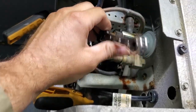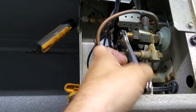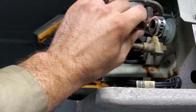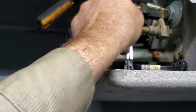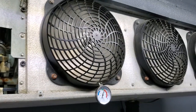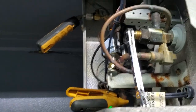It is basically brought out as much, it's maxed out. The valve should be sitting in the mid position, so I can't open it. I can't, you know, bring the stem out anymore. So someone's been cranking on it. So we're definitely going to, I don't know if I have a pressure limiting power head. This is a coil that kind of requires pressure limiting. But I definitely want to pull that strainer. I'll have to see what I have here.